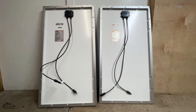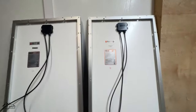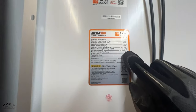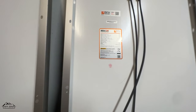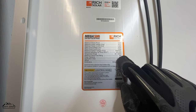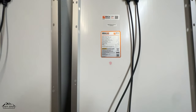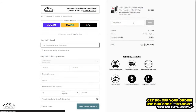Pretty much the National Electric Code says that you need to fuse a parallel array if the short circuit current is higher than the maximum series fuse rating of the panel. A lot of panels out there have a 15-amp maximum series fuse rating, but this one — the Rich Solar RS-M100 — used to have 15 amps. All items in this video will be linked down below.